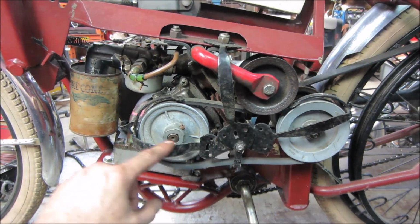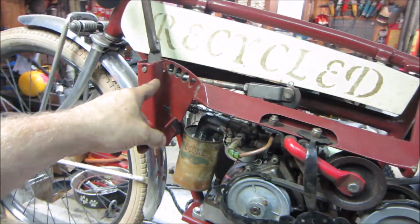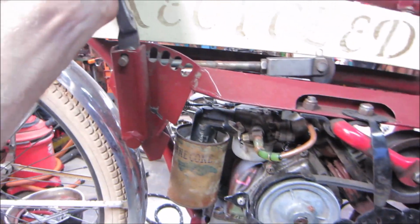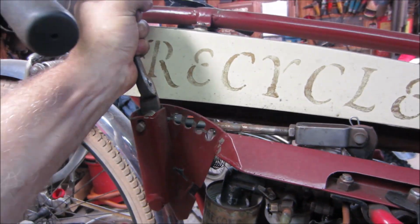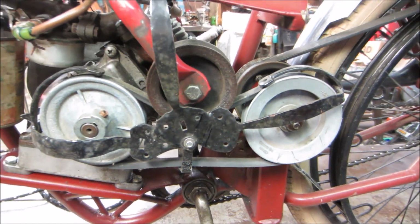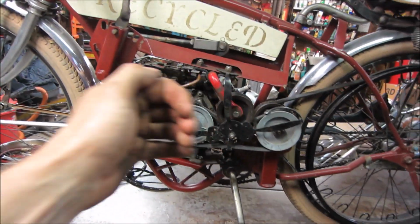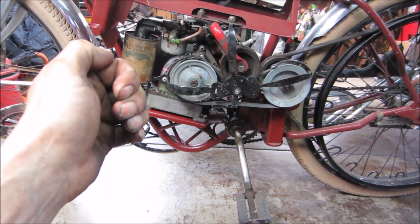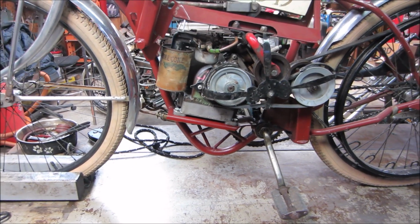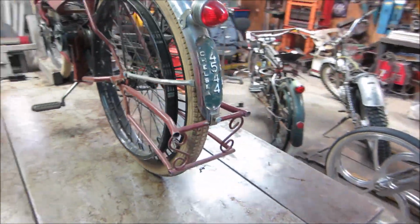These are little door handles, and here's the pole of the door handle coming in. This is off of a lawnmower, the raise and lower for a mower deck, and then some of the linkages. So you pull that back, and select the pin, and you can see where it just locks into the drive there and makes your driving. You can slip this one pretty easy because you're pulling towards you. So you just leave it in the out position, give it some throttle, slip it, get the bike moving a little bit, and you lock it in. But again, these don't like stop and go traffic either. You kind of put it in gear and go.